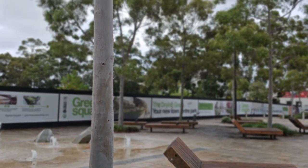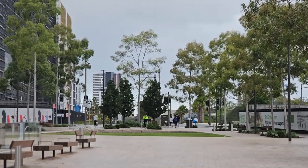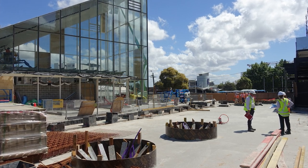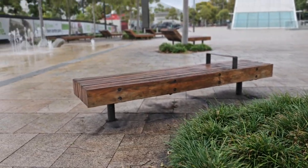So when we first started making Stratavault modules and our previous modules before that, Strata Cell, etc., it was mainly for the use of urban tree growth. So we put the cells around the trees, giving the trees lots of soil volume, which creates nice trees. These days, we're actually using the Stratavault also for stormwater management. And actually we find that if we use the Stratavault soil cells to treat the stormwater to feed the trees, they are growing a heck of a lot faster.